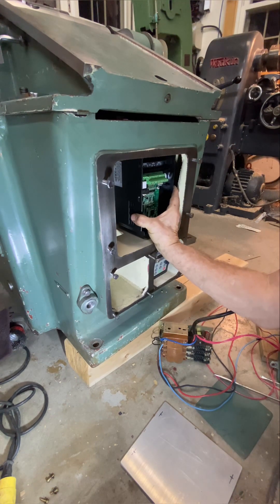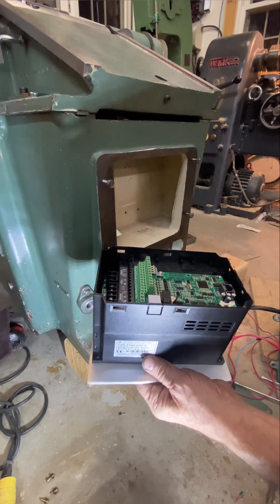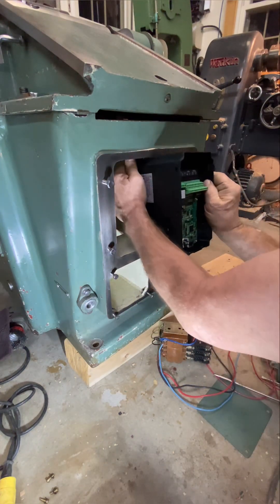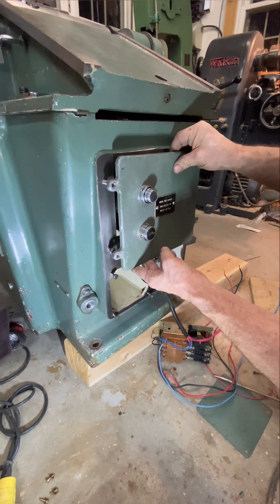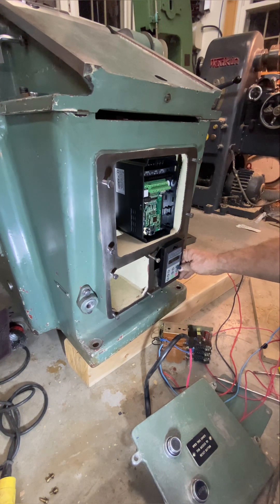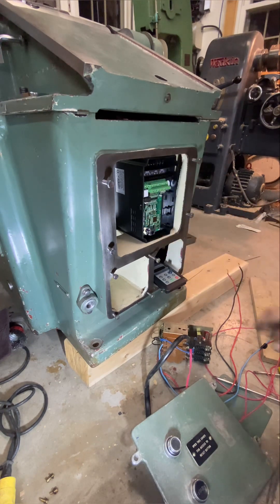The issue is I don't really have a way of attaching it very easily, so I'm going to mount that onto an aluminum block that I'll tap on the side, and then I'll be able to just screw that unit in. I can make all my connections and then install this whole unit. I've got lots of room. We're going to use the existing switchgear, which has tons of room, and we'll mount a remote keypad kit in this other unit, which allows you to clear faults, make adjustments, or monitor things such as the heat of the variable frequency drive. The aluminum will also help as a heat sink — these are very robust.